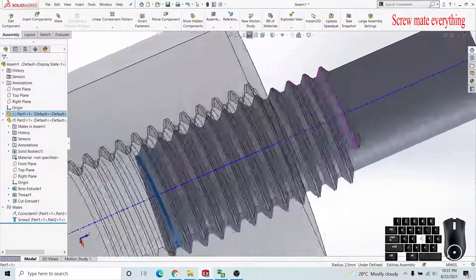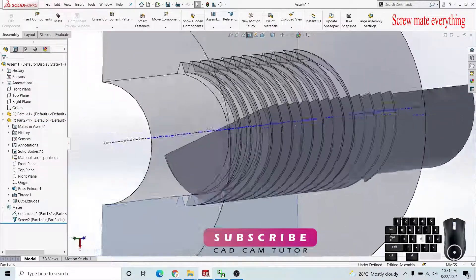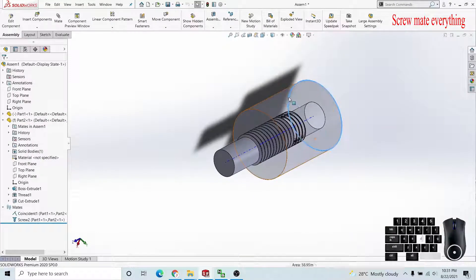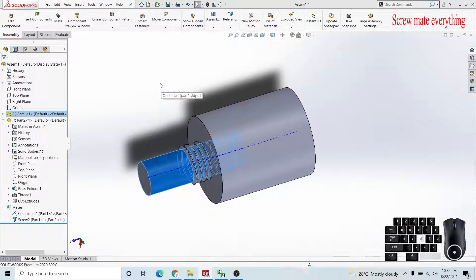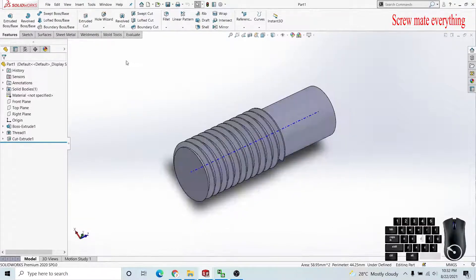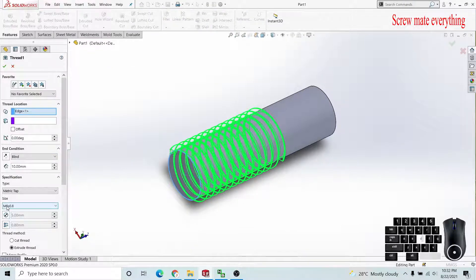You can see it is already meshed perfectly while moving around on the thread path. Now I will show you clearly what I mentioned before. Now it is time to design the part again. I will release these restrictions and go to the design. What I have drawn here uses in-built thread cutting — in-built threads. I have chosen to design the thread with a diameter of 5 millimeters.